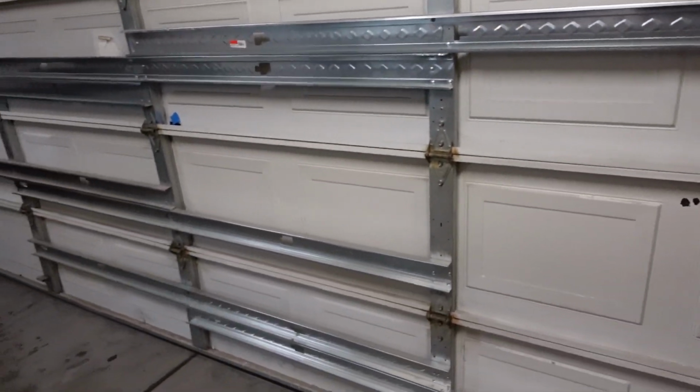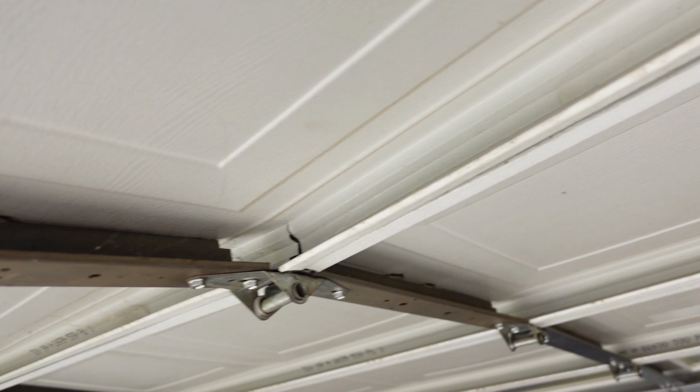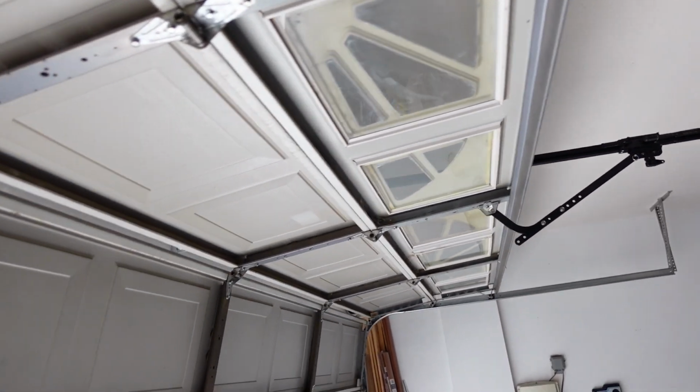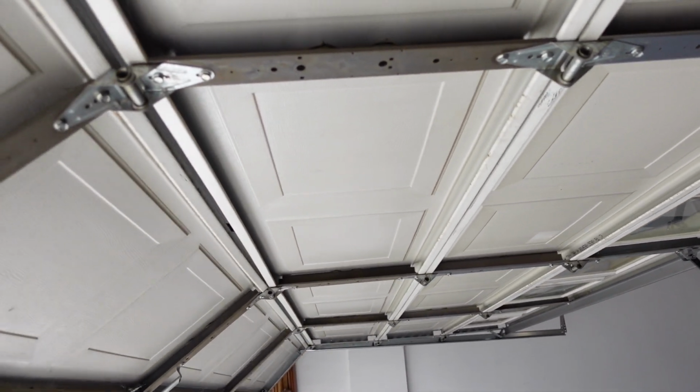It's not necessarily the proper solution, because these drywall studs are designed for drywall. So these pieces of metal are used out of their context, out of their design purpose. And thus we have to ask the question, okay, are we really doing good for our door applying something makeshift, or Jimmy-rigged, Mickey Mouse, whatever expression you want to use? Are we applying something that's clearly not right for the door?